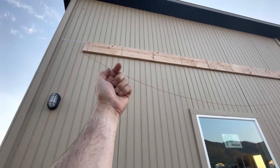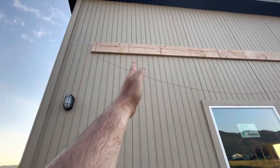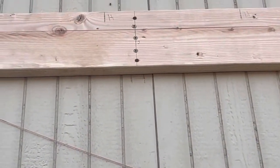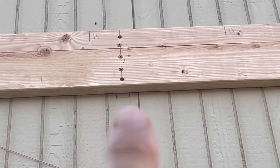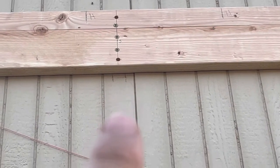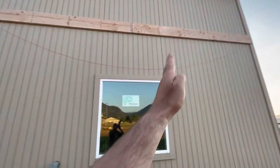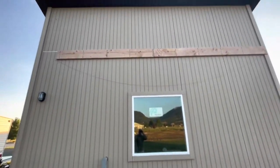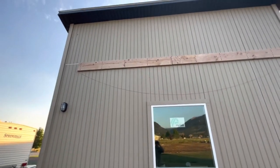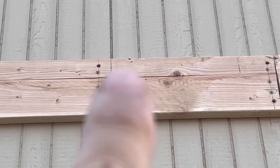So I went in through the attic and drilled a screw next to each truss so it poked out right against it. Then I was able to measure - you can see where I marked the truss line. The screw hole would be on the left or right edge, the truss was an inch and a half wide. I went across on a ladder, measured to each truss center, then called out the measurements while they marked all the joists down below.